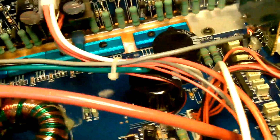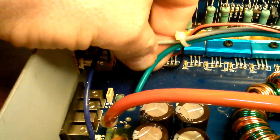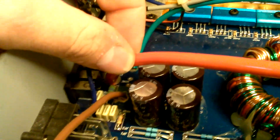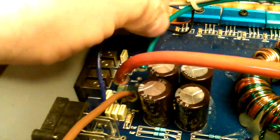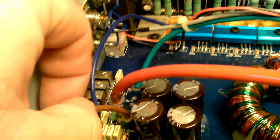The common ground for the speaker outputs is a nice healthy 8-gauge wire — big chunky one — that's your common ground for both channels. But the wires for positive and negative rails are only 12-gauge or less. So you do the math on that: when it has to push the speaker in and out with positive and negative rail voltage, that's not exactly a good thing. That's another issue.